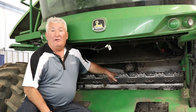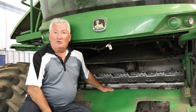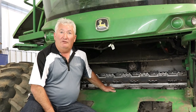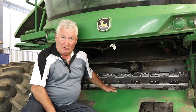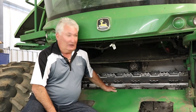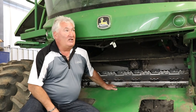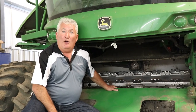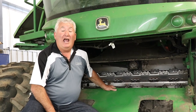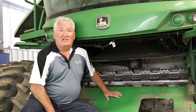That eight-wing feed accelerator upgrade really helps things out. The feed accelerator is also available in the rear as your discharge beater, so if you're having discharge beater plugging issues you can put an eight-wing discharge beater in the machine as well, enhancing performance. It really makes quite a difference. It's an upgrade on newer machines — we're now bringing them in with the tough crop package which includes the eight-wing feed accelerator and eight-wing discharge beater. That's the rundown on feed accelerators.